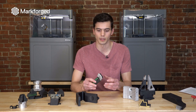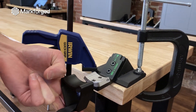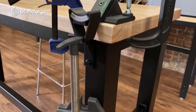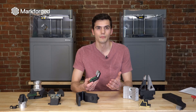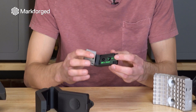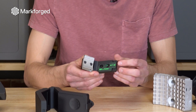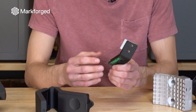With this approach we have localized the armature with carbon fiber reinforced onyx, and with that we get the strength and stiffness of 6061 aluminum but at a fraction of the weight. Additionally, what we see here is some metadata attached to the tool, included in the hardware — some orientations and the part number — and that is integrating the tool at the design level.